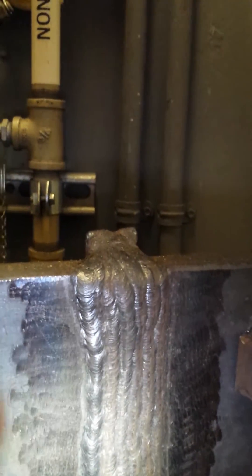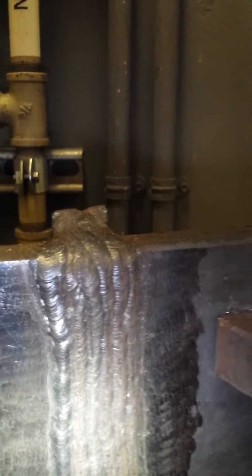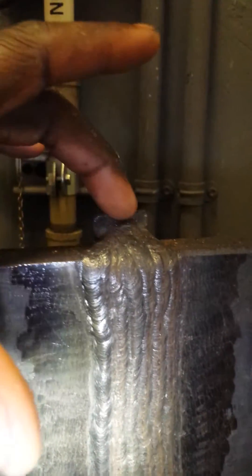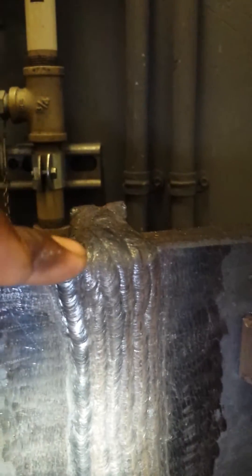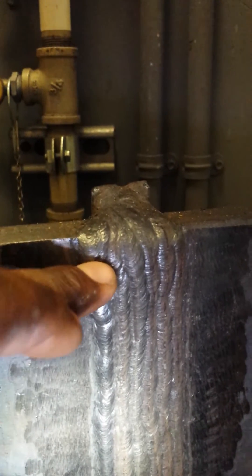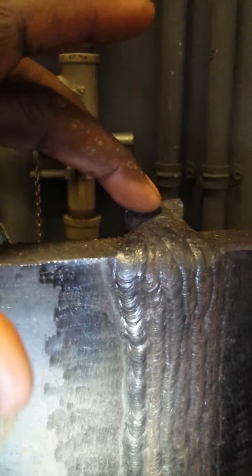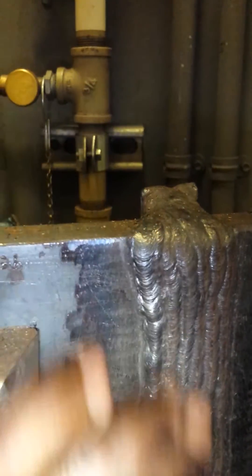As you can see, one of the most important things of welding this one inch plate — you've got to remember, a lot of times when you go in these test booths or these different companies, they want to see this right here. They don't want to see a lack of weld from this part to that part. So you've got to make sure when you're striking off, you're striking off from back here, using this backing strip to strike off and then drag and basically gradually make your way into your weld zone.